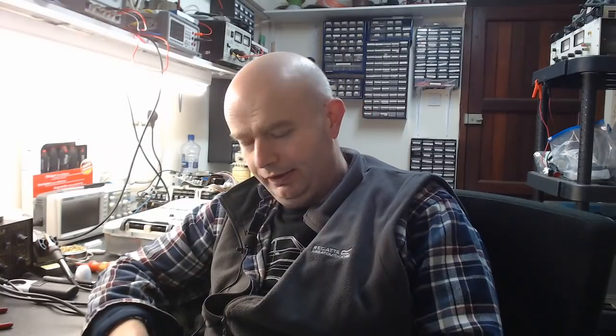So, why is that? Most good quality commercial chargers limit in two ways. They limit on current or they limit on power. Why did they do that? Well, they do it because they are trying to span quite a large voltage range. Like, for example, the Brusa NLG 513 will charge anything from 12, I think, to 500 volts for you. But it will either charge it at 12 amps or at 3 kilowatts, depending on which you hit first.